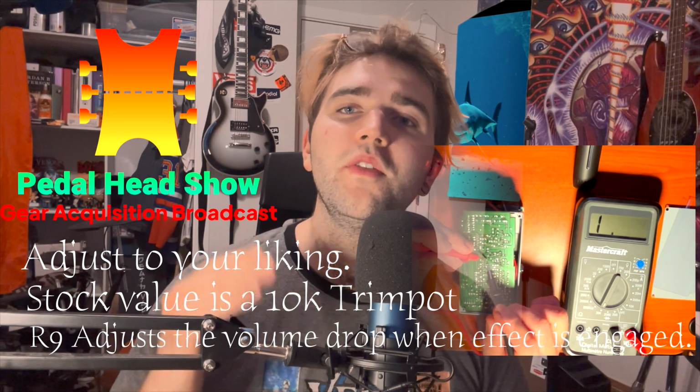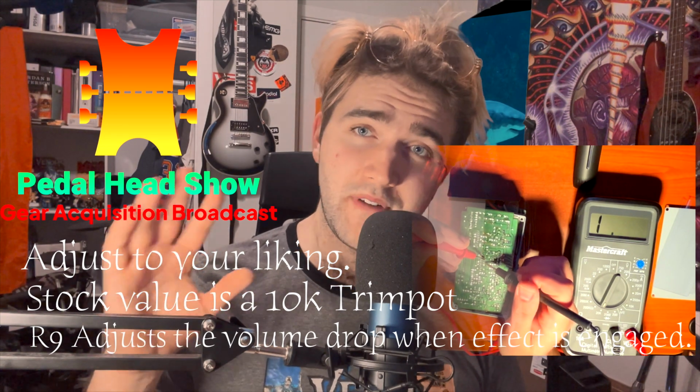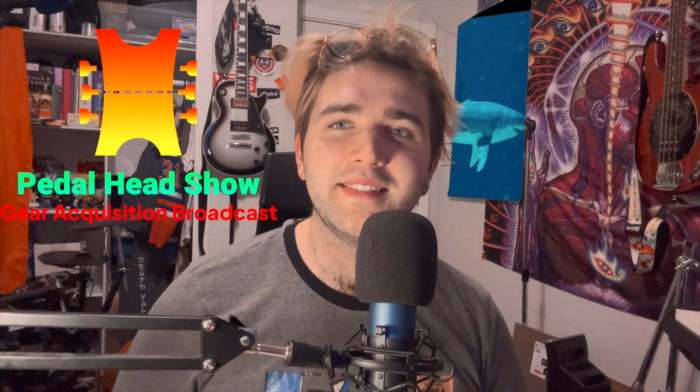All right, now let's hear the modded Boss TR-2 with R9. I set my trimpot to about 5.26. That's what the multimeter says, so we're going to go with that. Let's hear how that sounds.